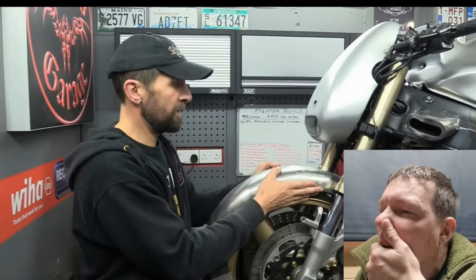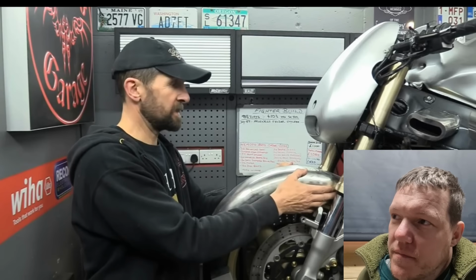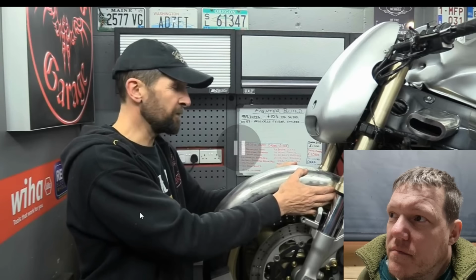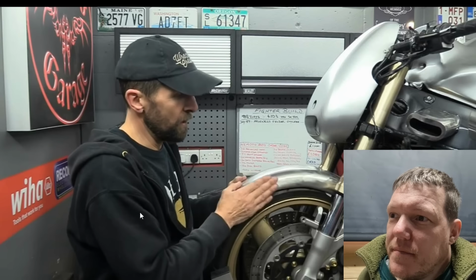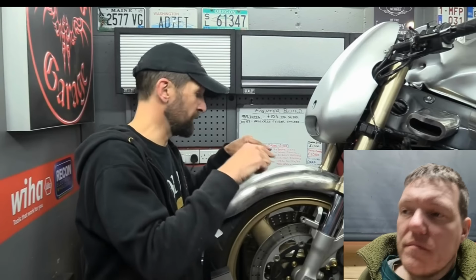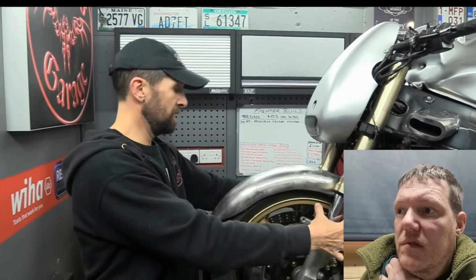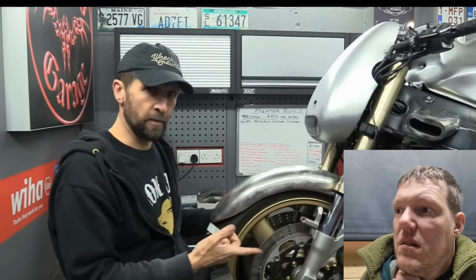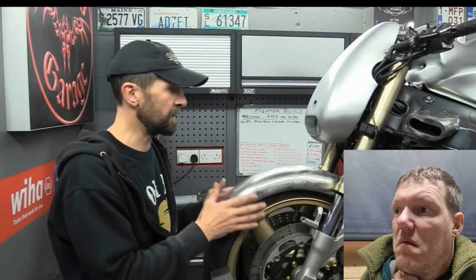There's about 3 mil either side between the mudguard and the fork legs, and I don't think that's enough. I want about 5. It should never move. So I may notch these very slightly, but I've got to know where that notch is going to be. So that's in the next video when I get involved in mounts, which have got to go onto here and here. I've got mounts at the front. There's lots of options. I might do something with tubes and bars. I might do something with sheet. I still can't decide, so I'm not going to get involved.